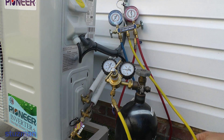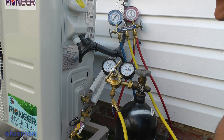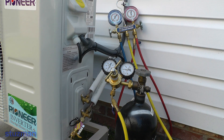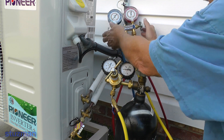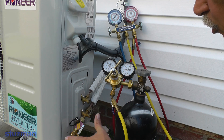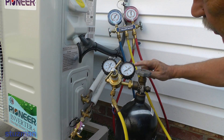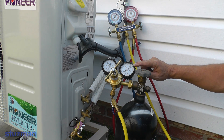Let's go over these lines. My service line right up here is connecting directly to the output of this pressure regulator which is on this tank. We're going to make sure that both valves up here are closed on the manifold set. We've got a valve open on the low side service line, and then we're going to crack this tank valve here. It looks like it's about 2,200 PSI on the tank.